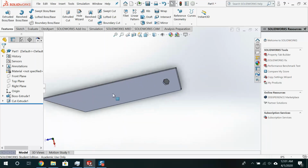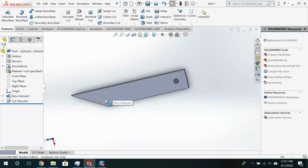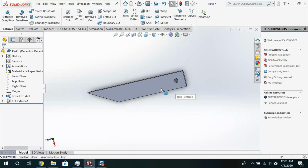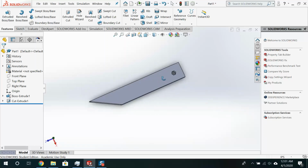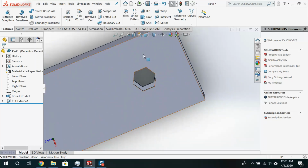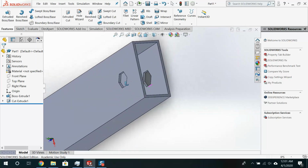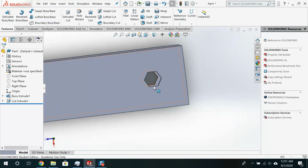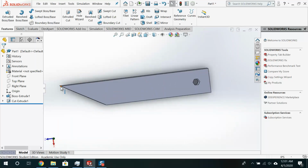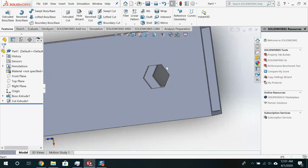a hex shaft through here to actuate my little flipping device. So this is one flipping device. Now, this is clearly not great because, first of all, manufacturing this is not super easy. There are other issues with it: the hex hole itself will strip pretty quickly if you put any sort of force on the edge of this. And so this is not ideal.